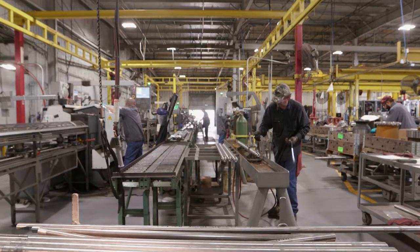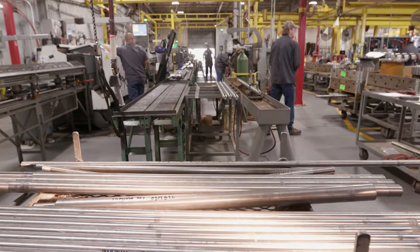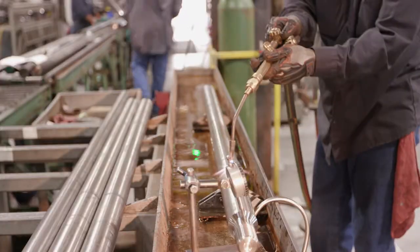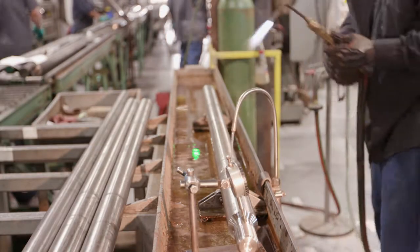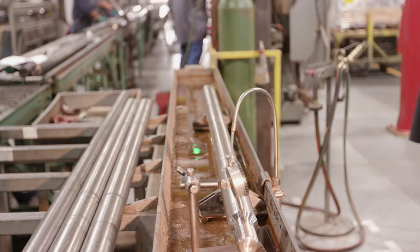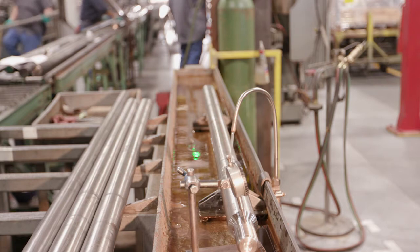What we're going to do today is show you how to straighten a shaft — whether that be a pump shaft, a line shaft, or a head shaft — and give you a rundown on the performance and why we do these things. It's real important for the shaft to be straight, and here in our facility we like to straighten them within about a thousandths of an inch of total indicated runout. By straightening it, you wind up not getting vibration in your pump in the field, which can lead to a failure.